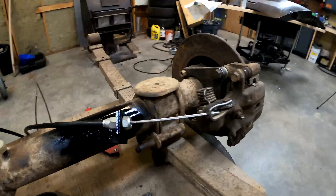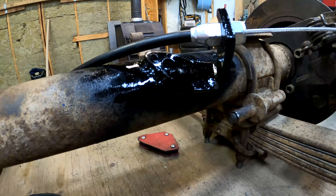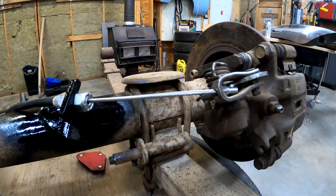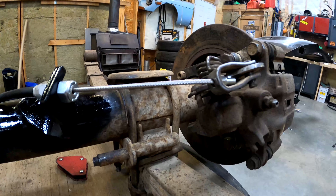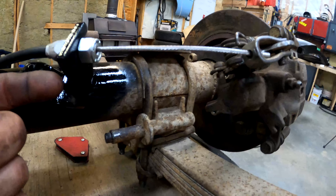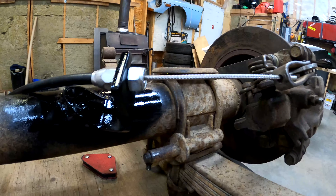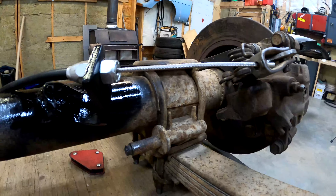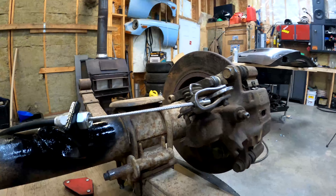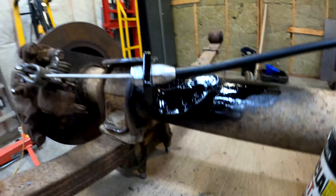You can see we're all done here. We've got our bracket nicely welded on and we've got the cable run to it. I realize yes, they are on different planes, but the only way to get them on the same plane would have been to have the plug down here, and then your cable would want to run through the middle of the axle tube. I tried it underneath, tried it on top — this was the closest I could get, and that'll be just fine.